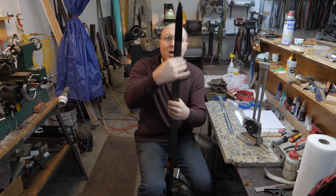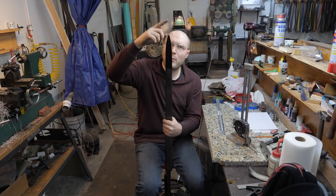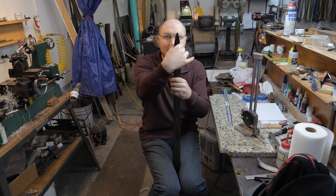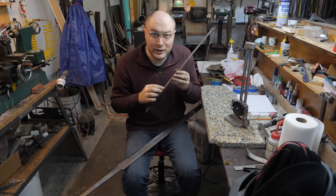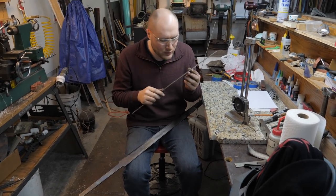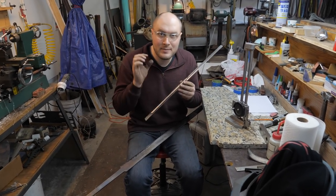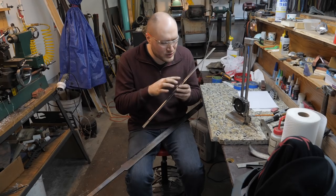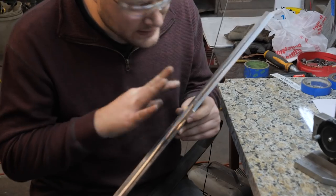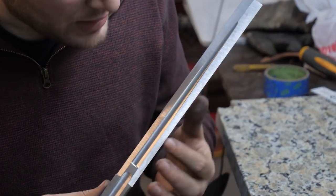It's straight from down here all the way up to about here, and then from here I wanted to taper all the way to a nice sharp point. I also spent a lot of time today trying to figure out the fuller. I had to go to town and try to get a bearing for my small wheel attachment — a smaller bearing — couldn't find one. So I actually found a way to make what I had work by wrapping a couple layers of tape around my small wheel, just to make it a little bit bigger so I could grind this fuller in and the bearing wouldn't hit in the way. Here's a rough fuller I ground in, and then I did some modifications — put some tape on my wheel — and ground it in with a tiny bit of taper.